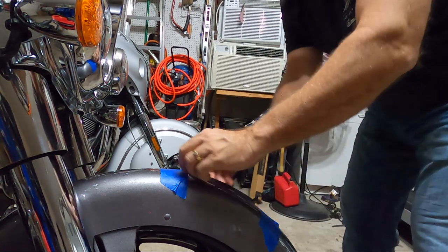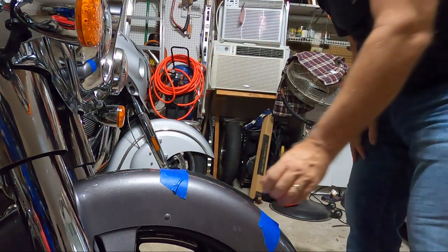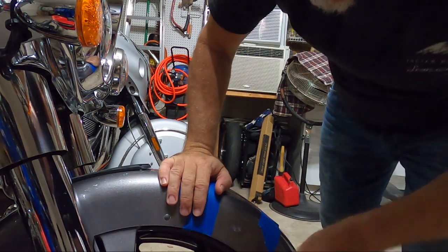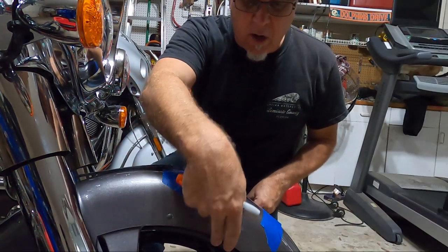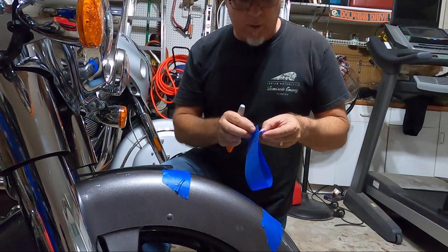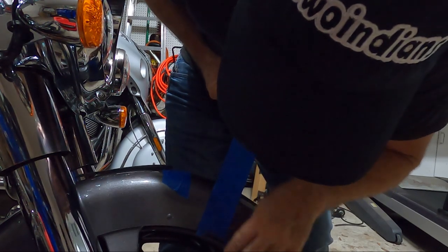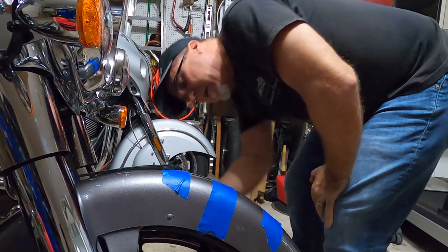But now I've got to figure out how I'm going to find center on this. Now I know where the front is. I mean I could just eyeball it, but I'm not a fan of eyeballing stuff. So I've taken a piece of tape and gone from one side to the other, and now I've pulled that piece of tape off, folded it in half, and lined up the lines to make a crease in the middle — that should tell me where dead center is. Line up where I was before, and that goes on there perfectly. Here's my crease.